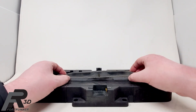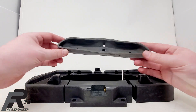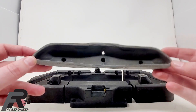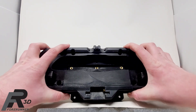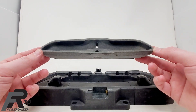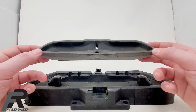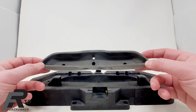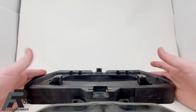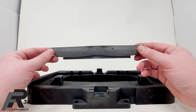When I heard they were going to redo this machine, I immediately asked the customer if we could get this nesting back, since they were doing a new round of nesting for the changing door handle geometries. They were happy to give it back to us. One question we get from time to time is how wear-resistant this TPU material is. The reason we put an insert in there — and you can see there are heat sets in the bottom of that nest — is that we knew so little about this material back then. We didn't know if it was going to last a week, a month, or a year, so we made it replaceable. If we wore out the TPU we could easily take it out and replace it, rather than replacing the entire nest.